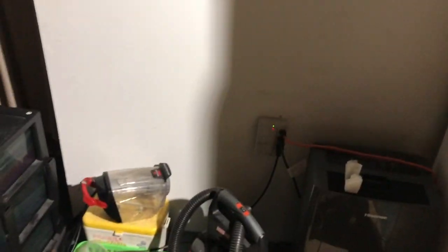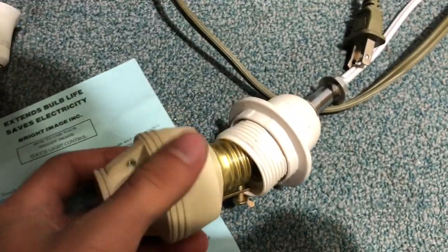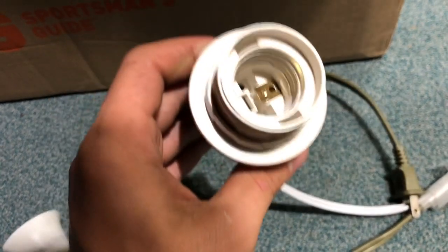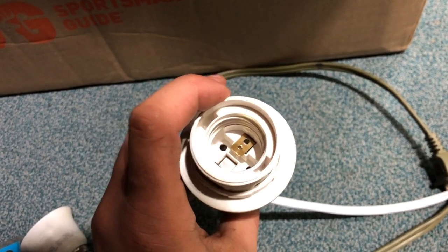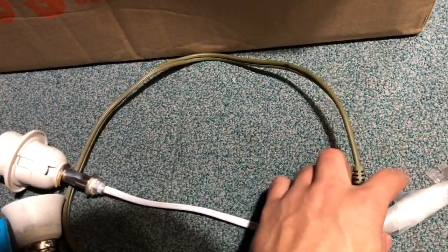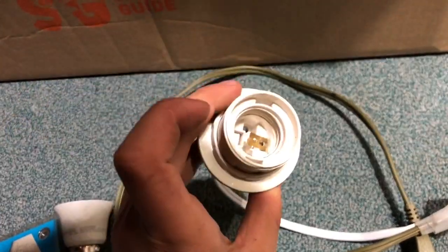Yes — when it's unplugged? Yes, it's unplugged. So I took this — this is the tongue actually. Here's another Edison socket from a lamp from a returned merchandise vendor, because this thing is so cheap and nasty. The person who's paid to flip this little contact down clearly isn't being paid enough, because it wasn't bent down. And the previous owner's inline switch detonated quite forcefully — there was soot everywhere — and they rightfully had it returned. So I had to bend that contact down.